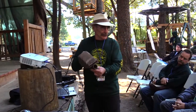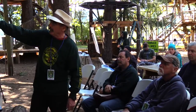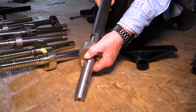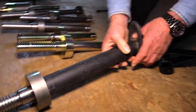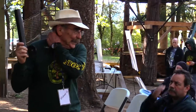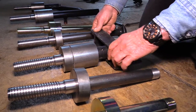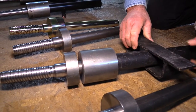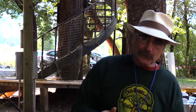The thing is, you can take this out. What I can do is put on a piece of pipe — I can take the same piece of pipe and put an extension on. So with most of my brackets, I use a piece of pipe. Take your bracket off, put a longer extension on, and move your bracket out. That's one of the things you want to look for when you get a bracket and design your treehouse.